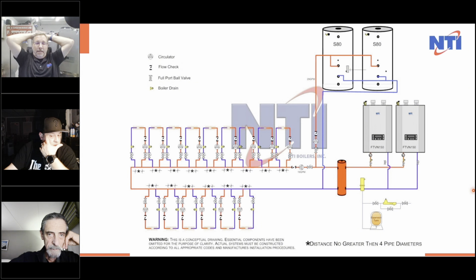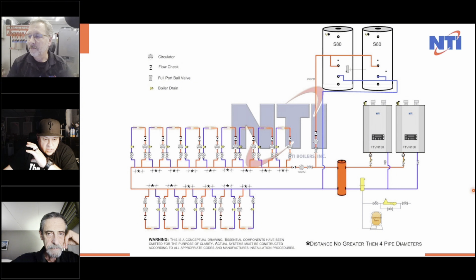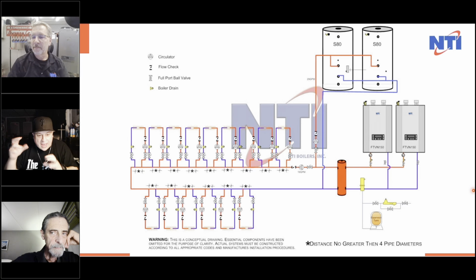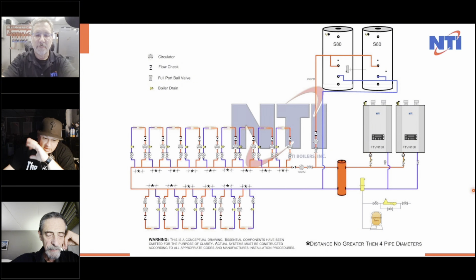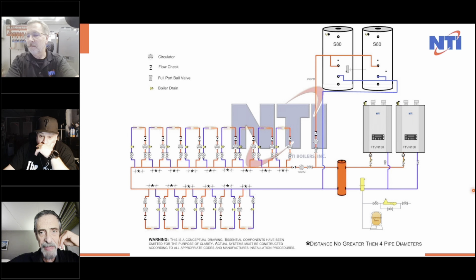They're amazing. You just said something, 20 degree delta T. How are you going to get the efficiency you need to get that boiler to reach its dew point if you're only giving it 20 degrees? Let's get that cold water to come back. Let it shock that heat exchanger, absorb that latent heat, condense. And the other thing, as I said, is that you have to set it for whatever design temperature that zone requires. And that's clear.